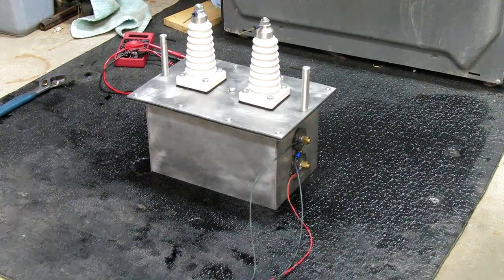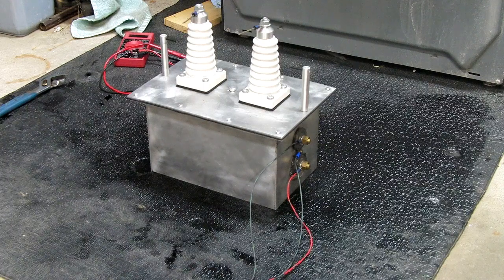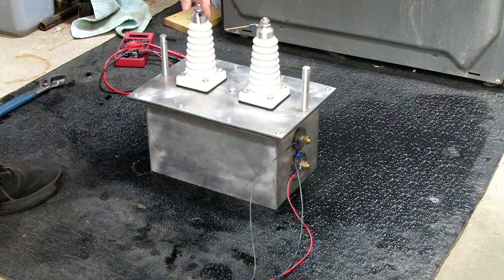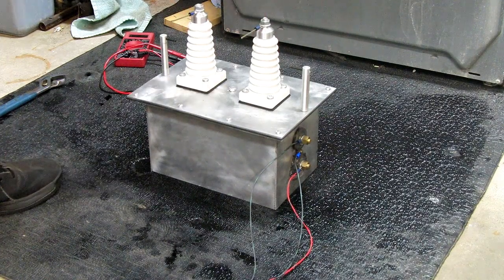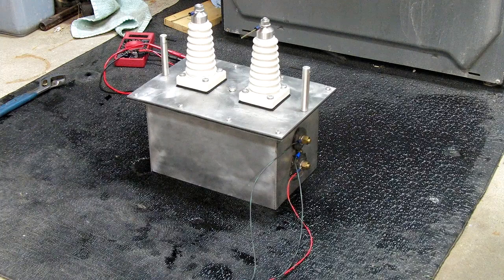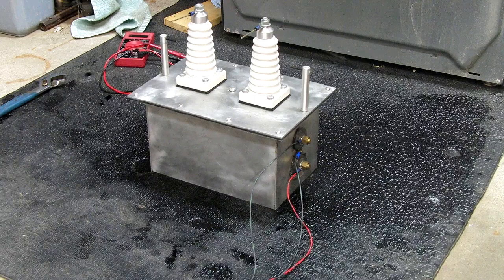The arc gap is set to five inches, which is about 120 kV in air. I have some little electrode tips on there so I can adjust the voltage easier — rotate them inward to lower the voltage, rotate them outward to increase it. It has arc safeties, so if it exceeds 120 kV it will arc to ground and won't go open circuit. When I first got this thing, the core was isolated from the windings by a little piece of paper, so I had to take that out and replace it with some Teflon so it can run open circuit without arcing to ground.